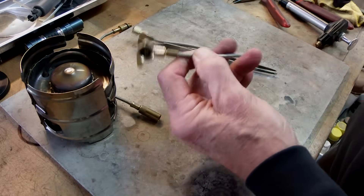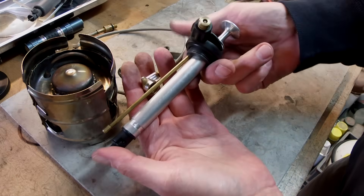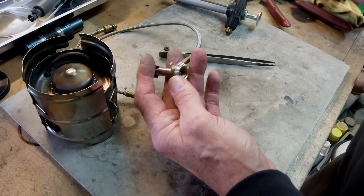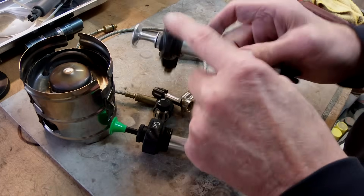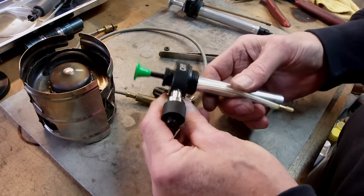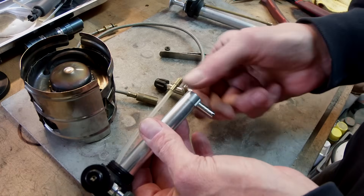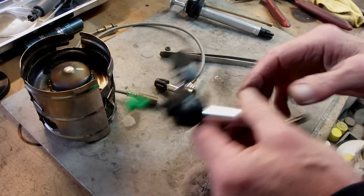With the Ergo pump hose, because it has a Lindell style valve, you can use your standard Ergo pump. These are available on eBay right now - shop around and get a cheap one. You can also get them from Primus by special order. What's really cool is you can even use an Optimus Polaris Optifuel pump. The Primus Ergo pump has a reinforced fiber plastic head, but the Optimus Polaris pump head is black anodized aluminum - as is the body. It's all one piece and more solid than the old Nova pumps.